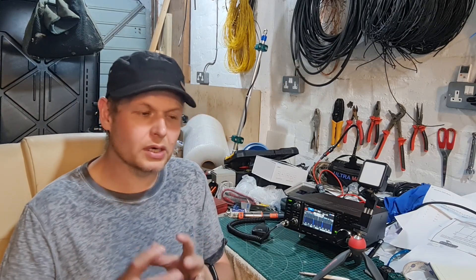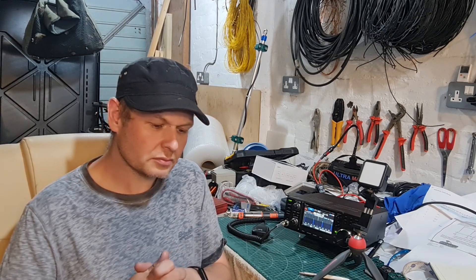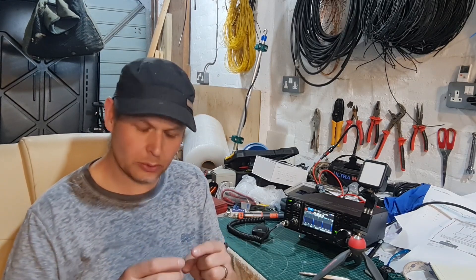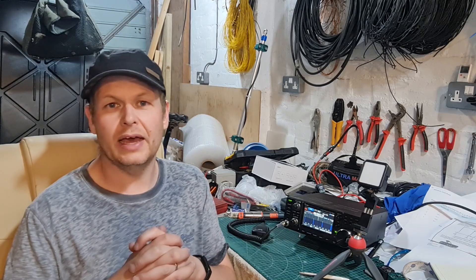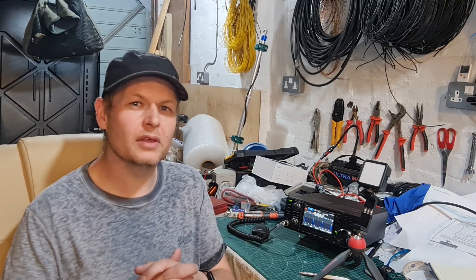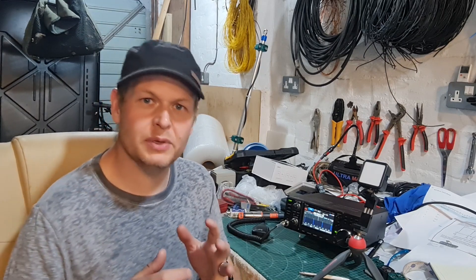On this antenna I deliberately left the coax capacitor a couple of centimeters longer and added an extra couple of turns to the coil beyond the calculated values, so I could trim and tune on the fly. I checked it with the SWR meter, trimmed the coax capacitor a little to bring down the match, then spread the coil windings slightly to reduce the inductance, achieving a good SWR. It's now resonant at about 28.2 MHz.